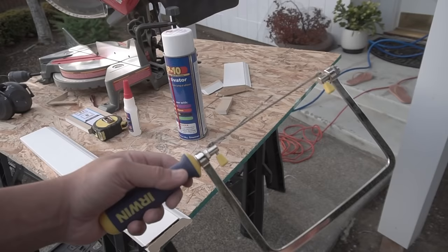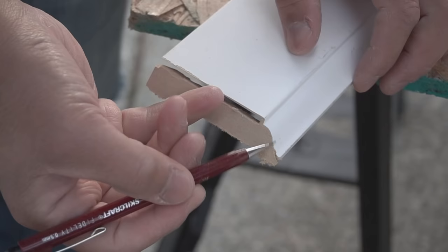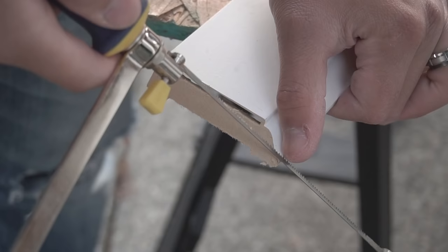What I'm doing now is the cope. What I'm using here is a coping saw with the blade and teeth on the upstroke, because I'm going to be cutting on the upstroke motion. With your pencil, mark the profile right there so that you know where you're going to be coping. I'm going to be slowly cutting on the upward motion until I get a nice groove.